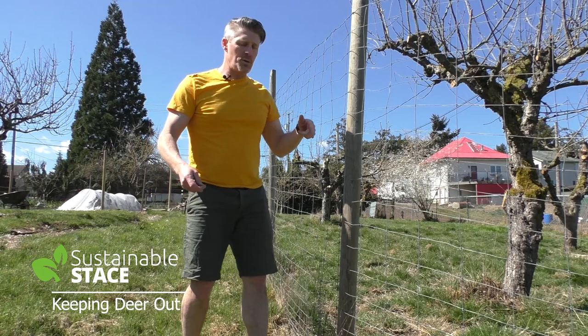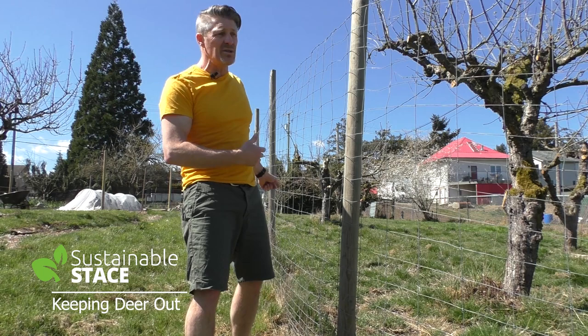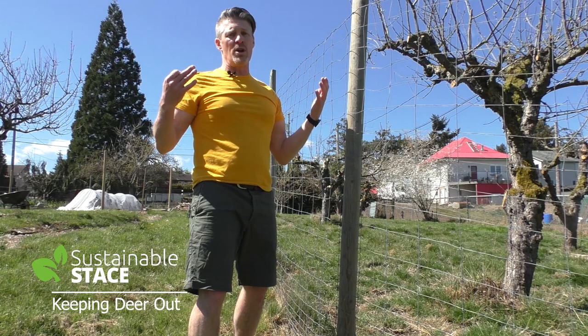About sinking your posts: if you've got power and a great big sledgehammer, go for it. But one of the quickest ways if you have six or more holes is to get a post hole auger. The most useful ones have four handles — one pair for a person on each side — with a motor mounted on top that you pull like a traditional lawn mower to start, with a big corkscrew auger that drills your hole, pulls up, and you can put your post in and pack it in. That's a really nice traditional way to do a fence — you're putting down roots, but it's one of your most guaranteed solid infrastructure ways to keep deer out.